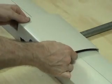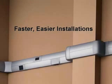Snap the cover straight on. You have now installed the DS-4000 Raceway over a common obstacle, a piece of existing conduit. By easily transitioning over these common obstacles, labor time is reduced by eliminating the need to stop one run of raceway and start a new one to bypass the obstacle.